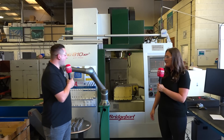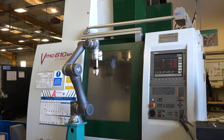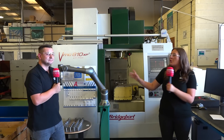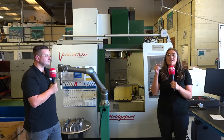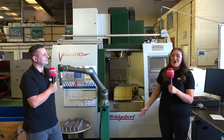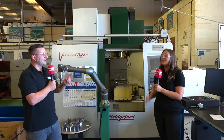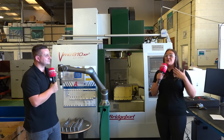How does it work? It can actually be done by the robot. The robot sends signals to tell it when to open and close the door for when the robot needs to load the part. If the day shift go off, we can set some parts up for the night shift and run all throughout the night. It's so easy to install. It works with every single manufacturer of machine and every single operator mode — Fanuc, Siemens, Heidenhain. It takes two hours to install and fit, so it's really easy to integrate.